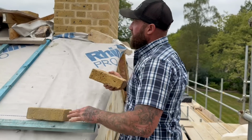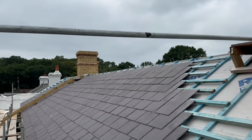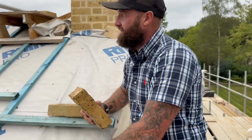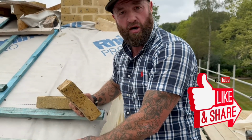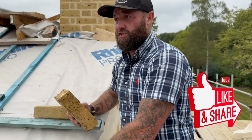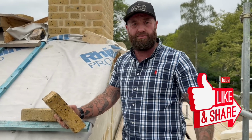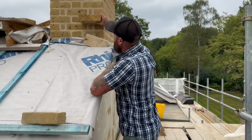Or if you look around, see the stacks? Every stack has to now come down carefully, neatly, because you've got slate on the roof already. There's a bit at the back, so we'll work it out so we're very careful and tidy. There'll be no throwing of the bricks on the scaffold into the skip. The bricks will be hoisted down, because I learned this a long time ago. Debris splitting, flying up, chipping windowsill, stonework, we don't want that, so everything's done carefully. So these stacks will now be rebuilt in the London stock.